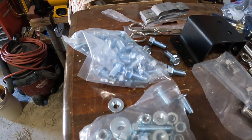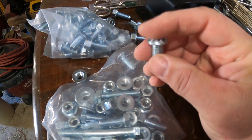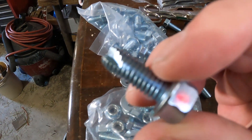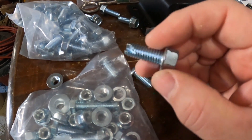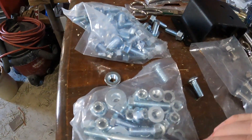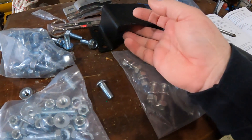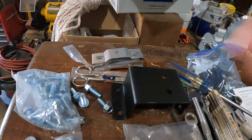I want to go into a little more detail about this because I've talked about them a couple times but haven't explained them. That is a round-headed bolt — just three-eighths by one inch — and you use an Allen wrench to hold it. Those go on top where the tarp's going to cover any bolts; you don't want a regular bolt head up there because that could cut the tarp. This whole bag is full of self-tappers — you can see how they're kind of cut, which enables them to self-tap in. That's what I'm using the impact for. There's also some stainless steel hardware; we got one bag of that and we're putting those in certain spots. I did talk to the manufacturer and asked if there was a special spot and they said no.